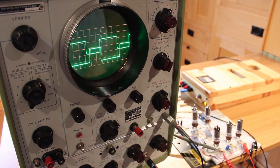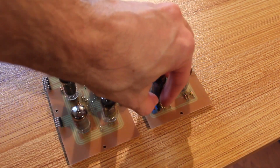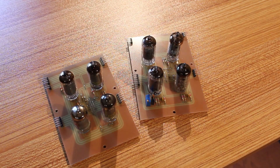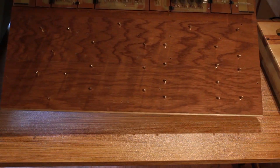Now all that's left is to cut out some PCBs and see if they work. Here are the PCBs — they look awesome. I'm really pleased with the way they came out. They're a little more spartan than the other PCBs we usually build, but that's because these are mostly cathode followers. You can see this is CLK2 because it has the multi-turn potentiometer here. I actually made a little socket for the capacitor so I can hot-swap to a different capacitor if I find trouble with that capacitor value in the future.